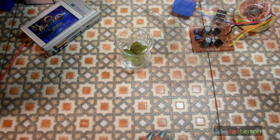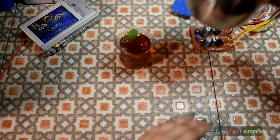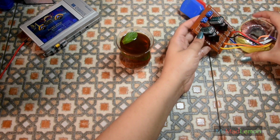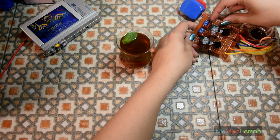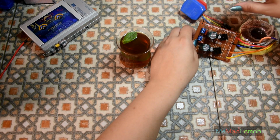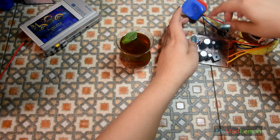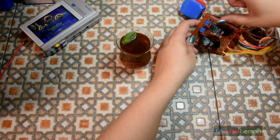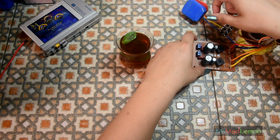Hello and welcome. So last time I created this beefy power supply here with full wave rectification over here, and I had initially put a regulator on there, but I thought to myself, why just congest this board here, because I'm going to need 3 regulators, because I'm going to need 3 voltages. Well, 2 of them are going to be 12 volts, since there's 2 rails here, might as well just make use of them. And there's going to be a 7805 because it needs 5 volt out for the SIDBoomBox.